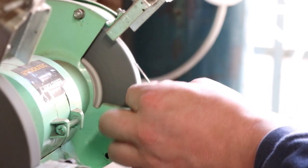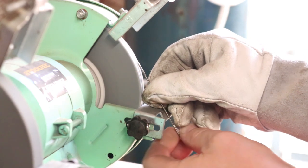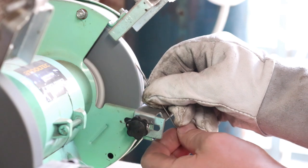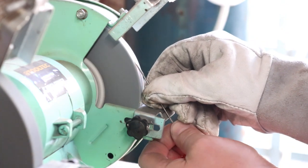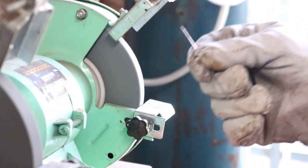So just using the bench grinder, I normally burn my fingers or make a hole in my glove doing this. There we go. So literally, the sharper your tungsten, without a doubt the neater your welds. So that's pretty good. We'll just pop that back in the torch,